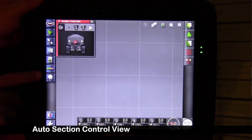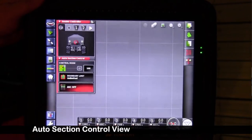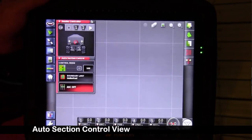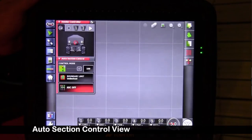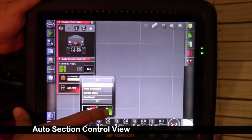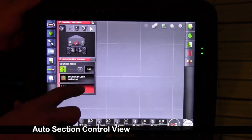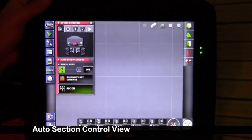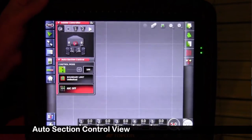Another very important mini icon over here is our ASE on or off. If you want guidance to turn it on or off at the headlands, you would leave this mini view up. We can have it set to whatever boundary we choose and the ASE on or off. If we had ASE on, you wouldn't be able to do any stationary test because it would think it's already covered that ground. So for testing, it has to be off.